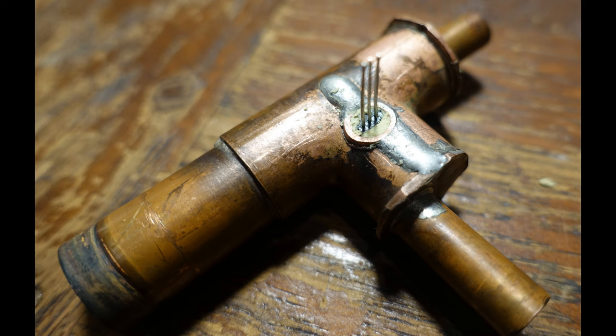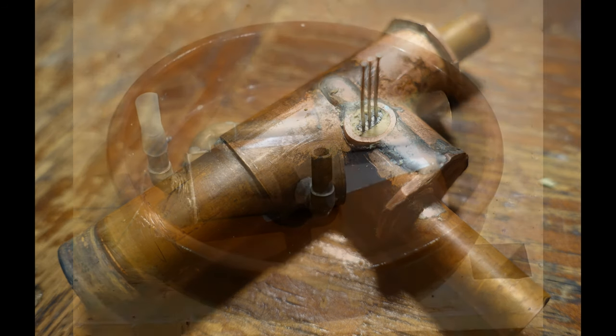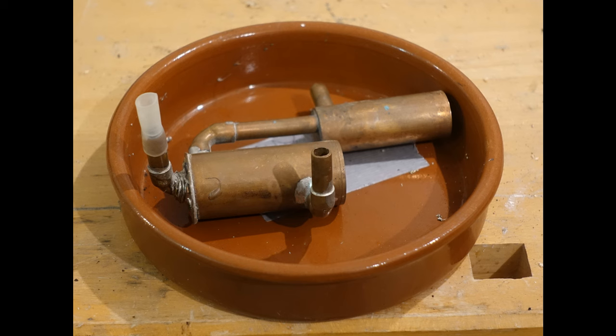When you have a piece like this, which is the bottom end of my stripping column, there are multiple solder joints on a small piece of copper. That means that when you heat the copper to do one joint the whole thing is going to get hot and all the other joints are going to melt. If it is not held properly then they are going to fall apart, particularly butt joints. This was my first attempt at a digital parrot and you can see that it contains 10 joints. It is just not feasible to rig up a jig that holds everything together and then heat it to make all the joints at once. It is much easier to make one joint at a time, but that leads to the problem of holding the previous joints together while the next ones are made.